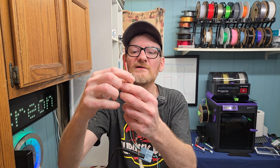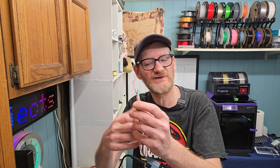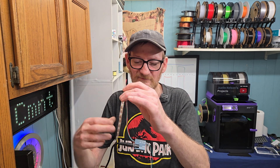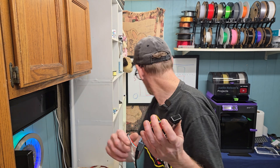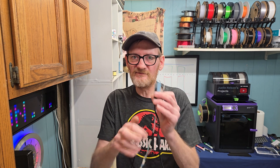No need to connect to the power injection wires; they're the same gauge wires coming in at the same point. If you want to add power injection, do that somewhere else down the line or at the other end of the strip — but that's another topic and generally speaking unnecessary.